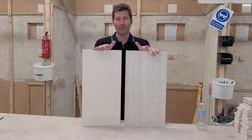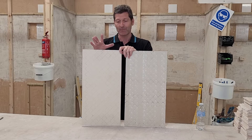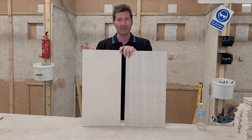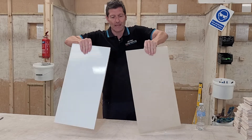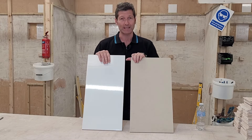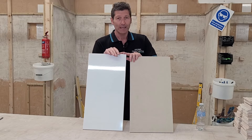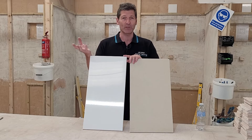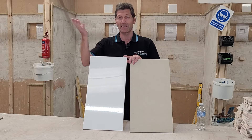If you get it wrong, these tiles could all come loose and they could all fail. Apart from the cutting exercise I've done on porcelain — it's a different way of cutting porcelain tiles to ceramic tiles — it's the difference of adhesives and what we've got to use to fix porcelain instead of ceramic. If anybody's going out there talking to customers, it's good to understand the products you're actually dealing with, and it educates your customer as well, showing them that you're educated in your trade.